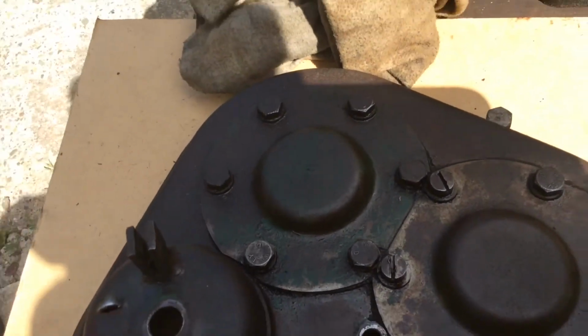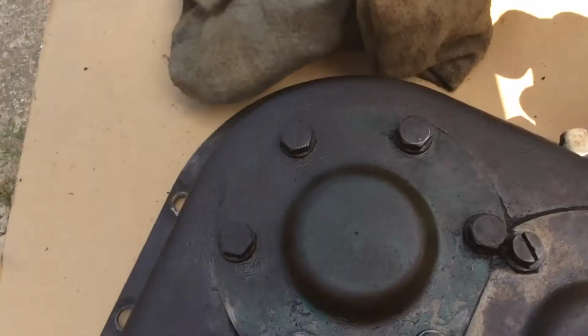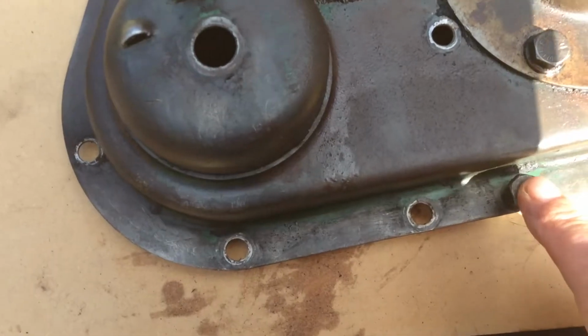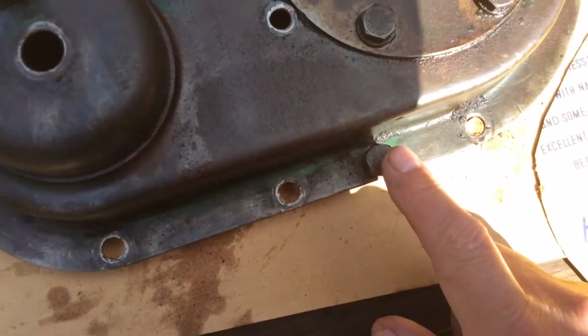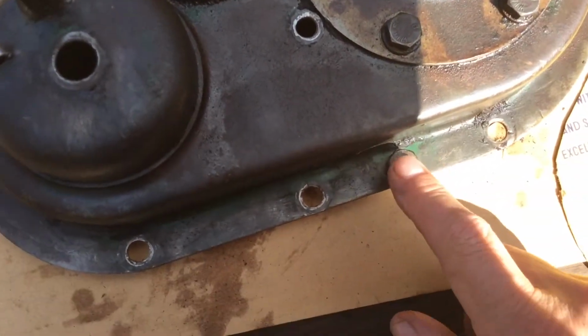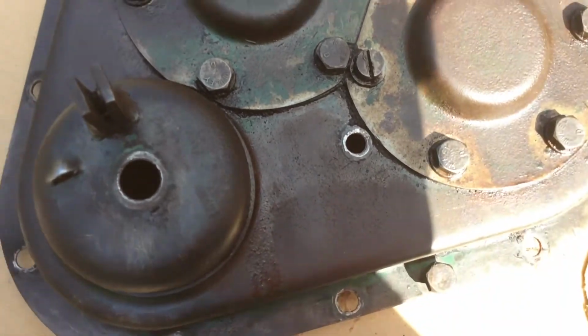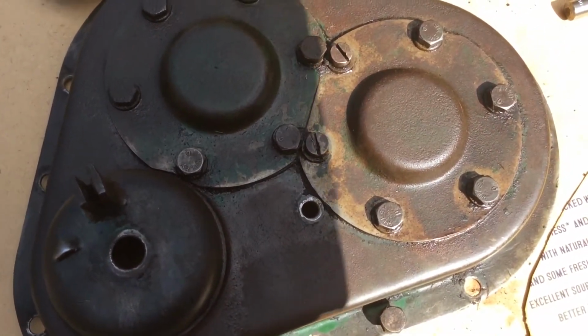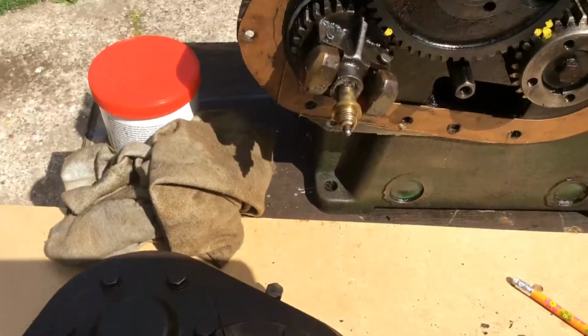and then when you're putting the sides back on, of course, don't forget the locator bolts. There's one at the top and there's one at the bottom there, so it might be worthwhile marking where them locator bolts go if you're not familiar with the Petter A1s or A11s. And that's about it really.